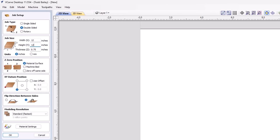The thickness of my material — we're over here in the UK so the material I have is in millimeters. The best way to convert it in the software is to type in 40 millimeters and then multiply that by 'i', so the software knows to convert 40 millimeters into inches. Then press equals on your keyboard and there we have it — 1.5748. Now if I wanted to go back to millimeters again I can just multiply that by 'm' and that will give me the millimeters. It's a great tip, and I know a lot of you know that already but for those who don't, that is going to be a time saver for sure.